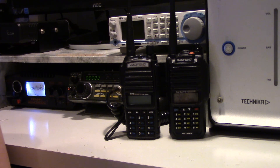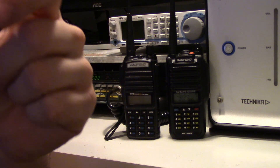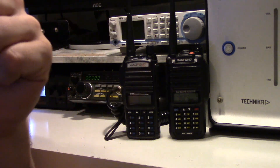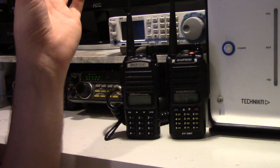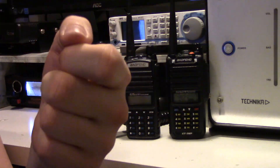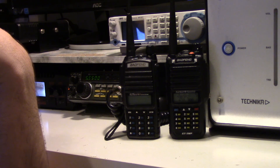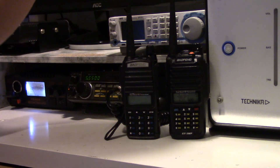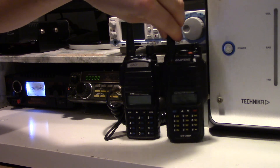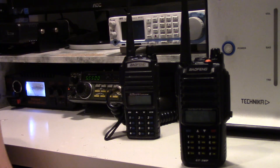The power — as I said — is a tri-power radio. It isn't 8 watts: low power is 1.3 to 2 watts depending on the band, medium power is 2.8 to 3.8 watts depending on the band, and high is 4.3 to 4.5 watts, again depending on which band you're using. So that's just one to watch out for. The antenna on the radio seems pretty good — it's a bit shorter than the UV-82 one but it does work well. I've had no issues with this stock antenna whatsoever.